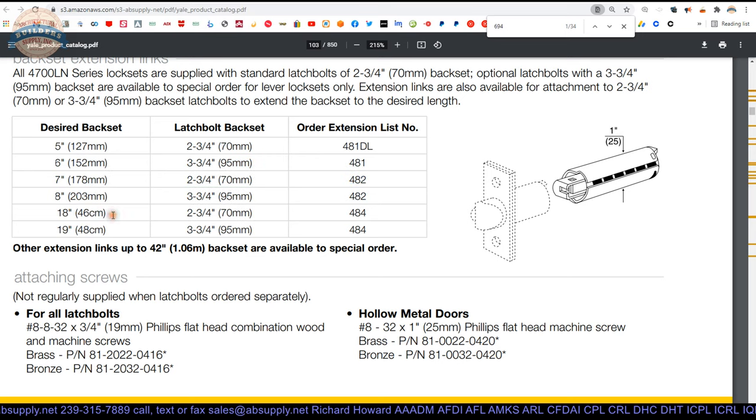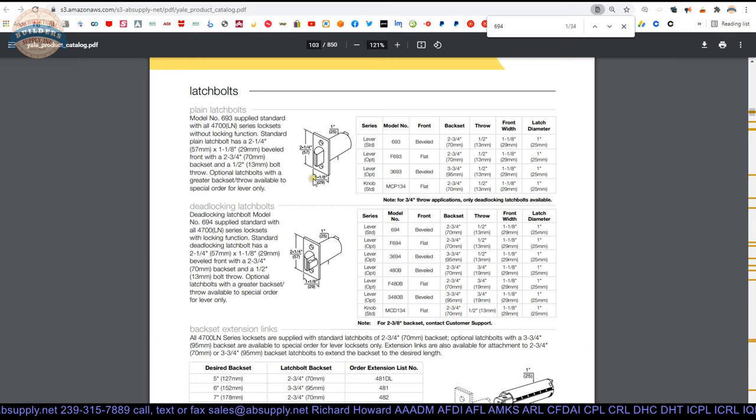When you get into other sizes, generally what you have is a door from the fifties or sixties where they put the lockset well back from the edge of the door because they were using very large decorative escutcheon plates. Schlage was a large proponent of that, as were many others — Challenger, Quick Set, and certainly Yale. In that mid-twentieth century era there were beautiful escutcheons, and you needed a great long backset to make that happen, achieved with extension links. I've seen them also welded from Yale.